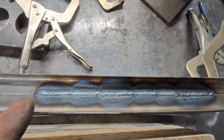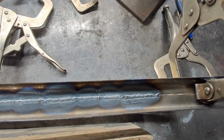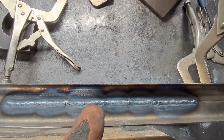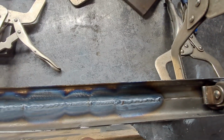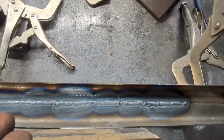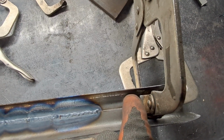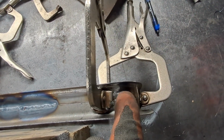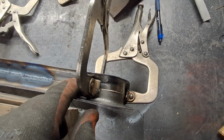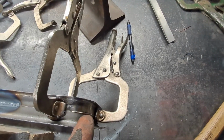Okay, I thought I'd bring you in real quick. You can see my starts and stops. And as I'm coming along here now, I had a little bit of a gap right here. I'm running into a little bit of a gap there, and that heat signature starts to expand a little bit as I'm dropping. Now we're getting to this area here, and I can feel a small edge as I work around into this corner. So now I'm going to get as close as I can and then start to take that 2-inch pipe and dolly as I work around that corner.